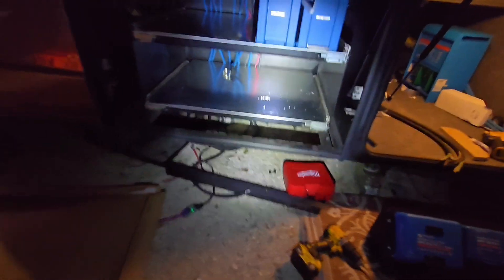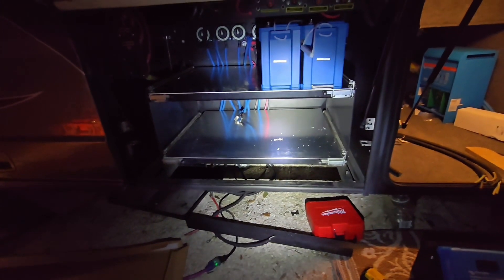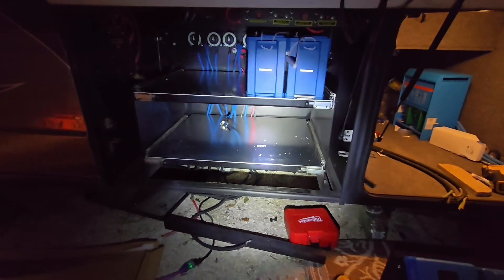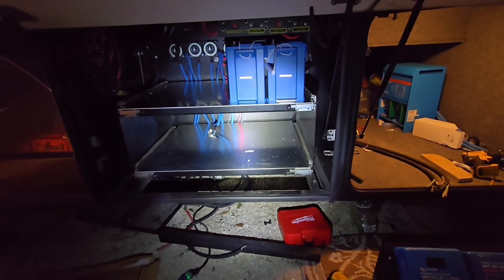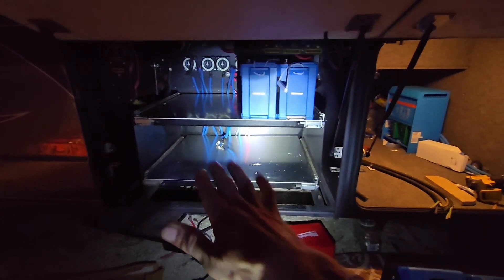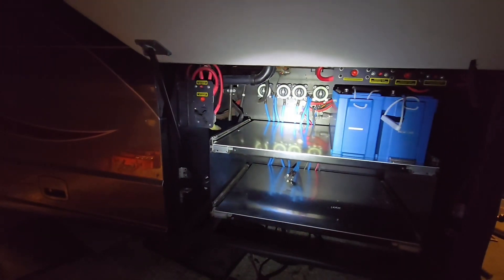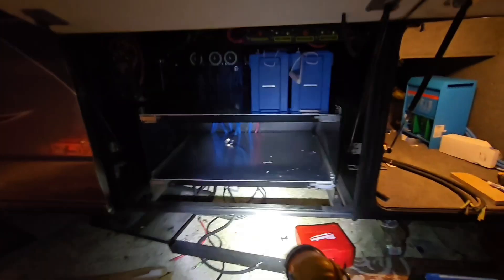This has been fun — like my plan C with this whole battery situation. Originally we were going to put them this way, but he was trying to have more than six batteries, so he wanted more than 1,200 amp-hours at 24 volts. That's a lot of batteries already, but it is a big motorhome and if you've got the space for it, why not. So we're going to try to get eight — I opened my mouth and said we could fit ten, but that's going to be very hard. I think we're going to stay with eight. It just wasn't very easy to mount a cutoff switch back there if I stack five up there. Where if we stay with four and four, you'll be able to slide along the side and hit those cutoff switches.